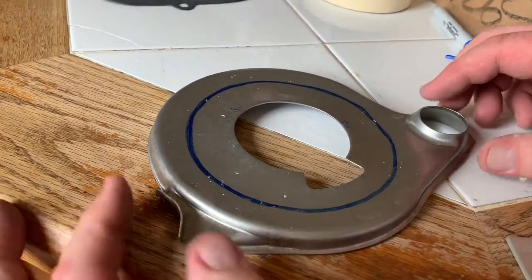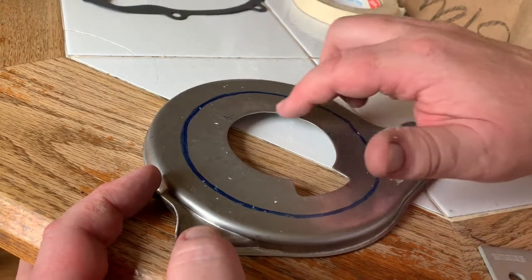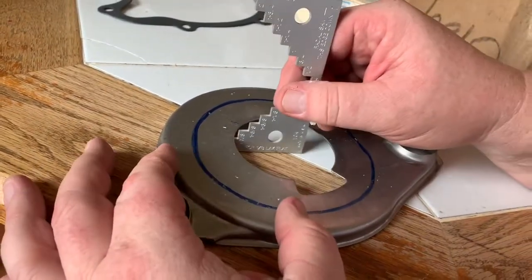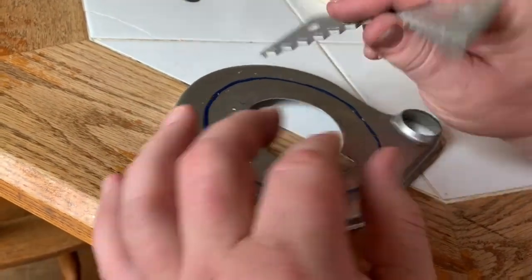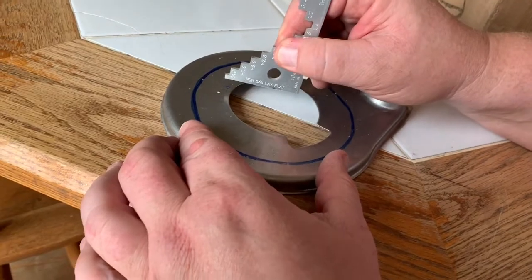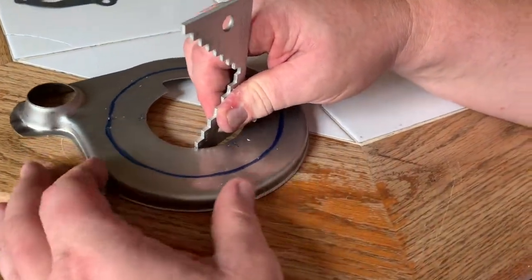We have a little bit of an update. I put the blue ring around the ridge so when you hammer it down on the workbench you can see where to manipulate, because you don't want to concentrate only on the rim nor only on the inner part of the opening. We started out at the 5/8 mark; I've knocked it down to 3/8. These X's — actually pluses — are high spots. As I hammered I kept running the gauge and noticed where it was a little high. We're at 3/8 all the way around, but I don't think we're there yet.